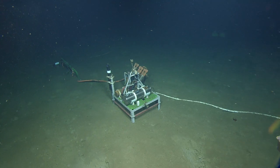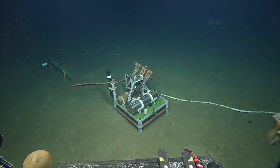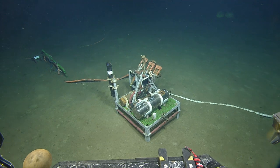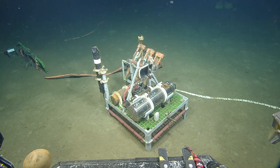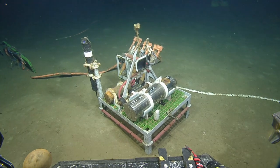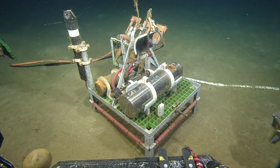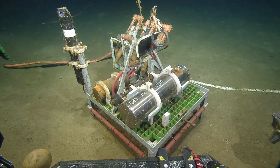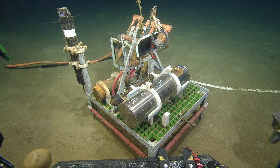Dan, have you dug one of these for us or for OOI? Yeah, several of them. Ballpark, how long did it take? Days. Several shifts. Does the ROV get a tiny shovel? No, we have a dredge, and we dredge out a hole, then we put a caisson in, and then we use the ROV as a hammer and pound on the caisson. And then we dredge some more, then we hammer some more. It depends on the soil. Sometimes it's easier to dredge out. Once you get them going, then you dredge out and press down.